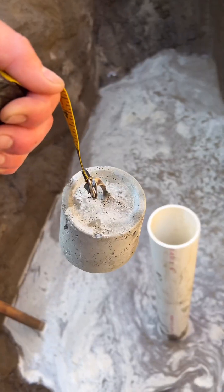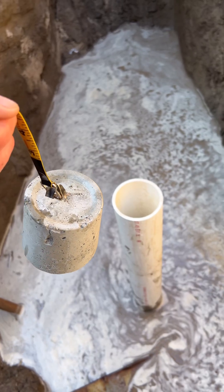Overall depth from the surface is 47 feet, which is actually greater than I thought we'd get, so we're good there. Water is sitting at about 23 feet from the surface. We're gonna keep the pump about 10 feet off the bottom. We do have a concrete plug I'm making right now to put in the bottom once we get it test pumped.